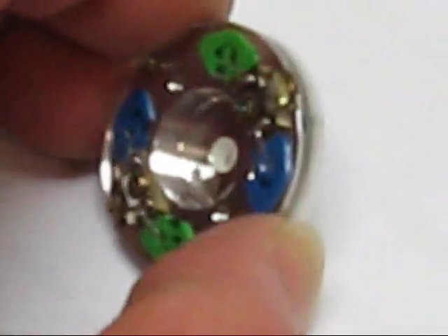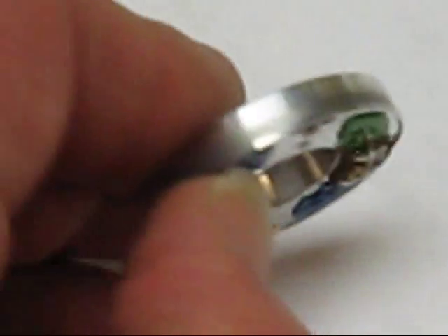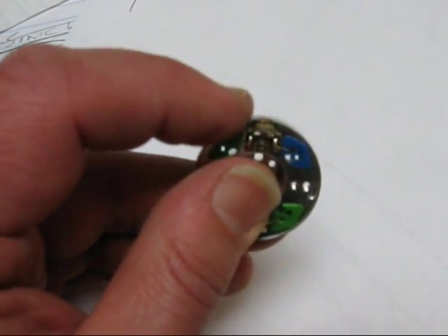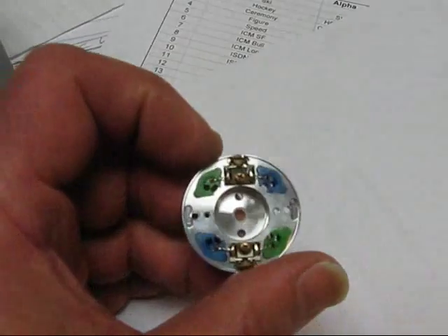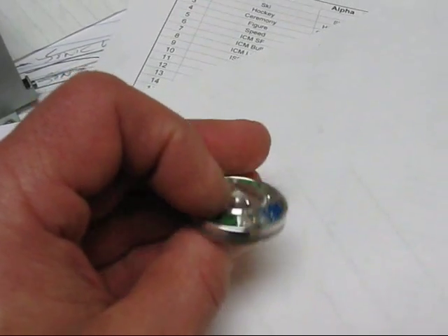Here is an actual used drum — this is the upper drum assembly, which removes from the bottom drum. As you can tell, it has lots of polish on it, which means it saw lots of tape pass over it. These are the two tape heads — about the thickness of maybe my fingernail, one little tiny piece of ferrite with a coil on it. They wear on the magnitude of microns. They're supposed to protrude slightly, but after enough wear they stop functioning and you have to replace them.